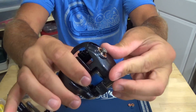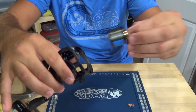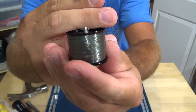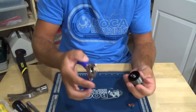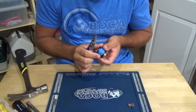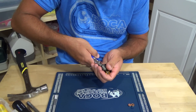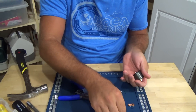Take the side cover, turn it down, and pull it off. Grab your spool — you'll see there's a pin going through the shaft. Get yourself some spool pin pliers; you guys can pick one of these up at Boca Bearings. Put the pliers on the pin and the shaft, line it up, and pop it out. Put your pin aside.